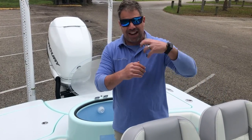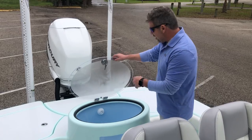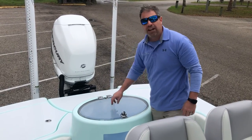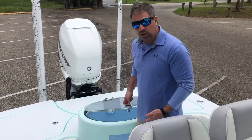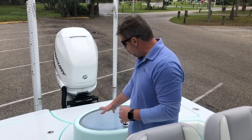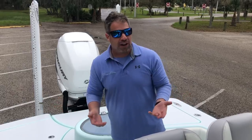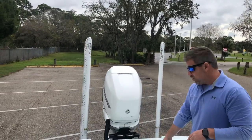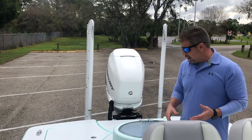He can control his water flow, his intake, and his outflow. This is a pressurized well. This valve right here — you have to open it up when this thing gets full because the water hits the airspace and it keeps all the water from sloshing around. So if you're out in a real foot and a half, two-foot swells and chop, your bait is a lot calmer. It's not getting beat up.